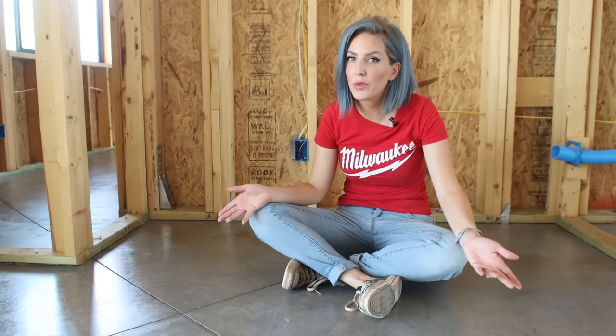Secret confession time: even though the product is recommended for steel trowel finished concrete — which is what we have — the sheen was a lot more uneven than I was expecting. I knew right away we'd want to wax or buff the floors to even out the sheen, so we decided to add a third coat of finish to make it a little thicker and prepare it for buffing. The floors already look much better with that third coat — much more even — and I feel really confident that with a little floor polish or wax, we'll get it completely smooth and even.